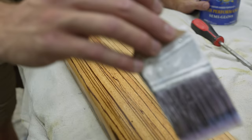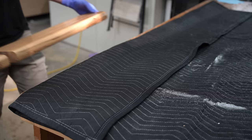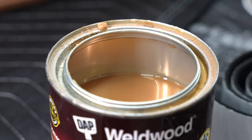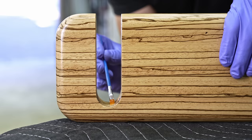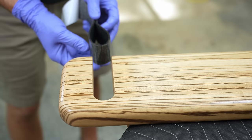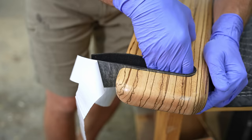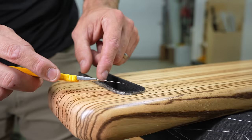The finish I'm using here is a water-based poly, which is a really difficult finish to brush on. I recently got an HVLP gun but I've just been too nervous to use it — still in the box. This took a few coats and a little sanding in between, but it looks really, really nice. For attachment, I'm not actually using adhesive directly to the table — instead I'm using contact cement with a sticky felt pad. The contact cement adhesive is really strong, so I thought it would be more durable. It took a little wiggling trying not to ruin the finish with adhesive, got it stuck on there, and let it cure before coming back to trim it up.